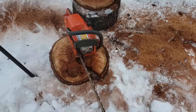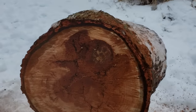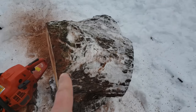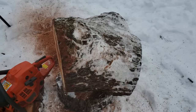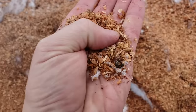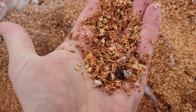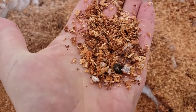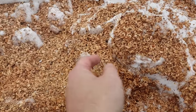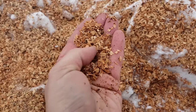We made our first cut and there's a little bit of rot in this cherry, so I'm going to make one more slice to get into a more even part of the log — I want it to be as equal as possible for both cuts. The shavings we're getting here aren't too bad — there are at least some chunky pieces. Cherry is a decent hardwood. The chain's not extremely dull, but we'll see if we can make it even sharper after running the sharpener.